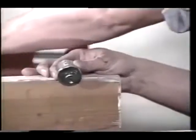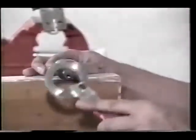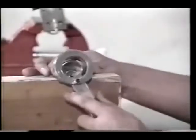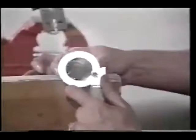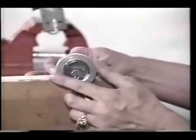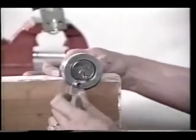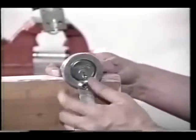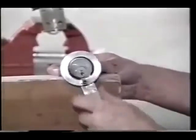Open the lock with a screwdriver. If you can get access to the lock and buy a $15 cylinder wrench, which fits over the lock, and as you apply pressure, adjusts itself to the lock, allowing you to turn it and rip it out of the jam. This is usually impossible if the lock has a guard ring around it, preventing entry.